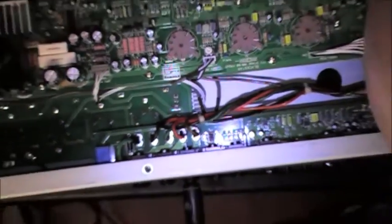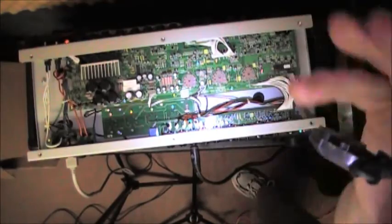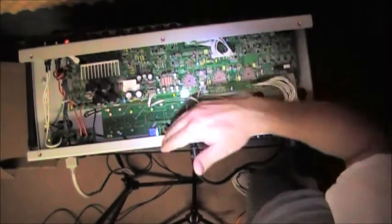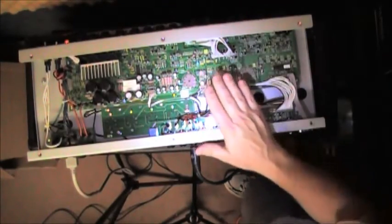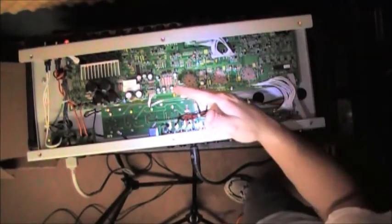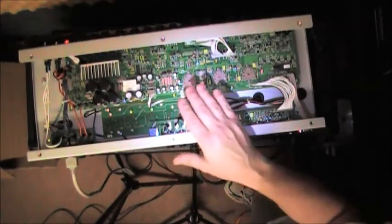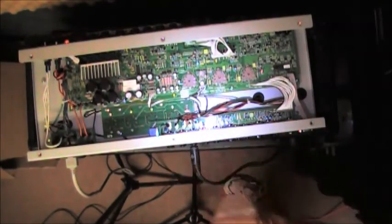I will tell you the new tubes, by comparison, sound darker. For you tone freaks, that might weird you out, but for whatever it's worth, I think the amp sounds great. I'm going to leave it at about 99.1, which is what I registered on the bias voltage. Between rehearsals, playing at church and playing out, I would say that after about three months of that kind of activity would be a great time to recheck the bias.